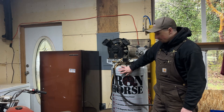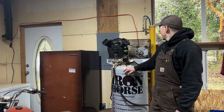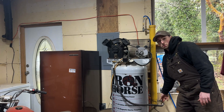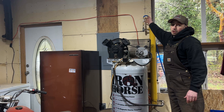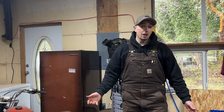We're running an 11 CFM air compressor, which should give us enough throughput of air to keep up with our cutting duty cycle. We also have a really large desiccant air filter - the air comes in through the bottom and plumbs all the way up through the top, running directly to our machine. On the plasma cutter side, we're running a motor guard just before the input to get rid of any extra moisture or contaminants. So far this has been working really well for us.